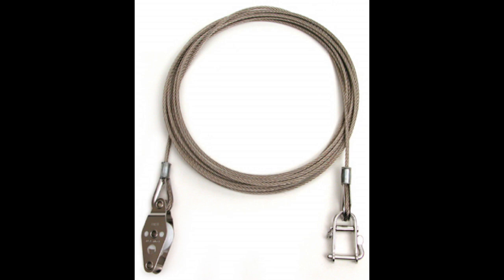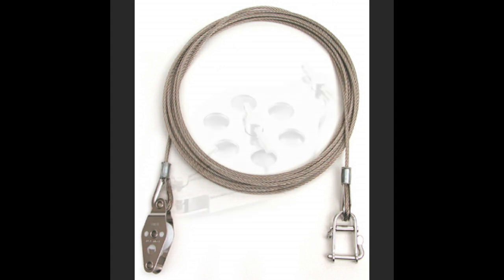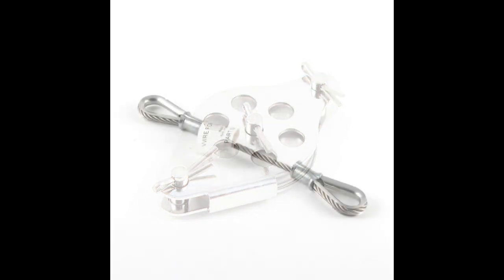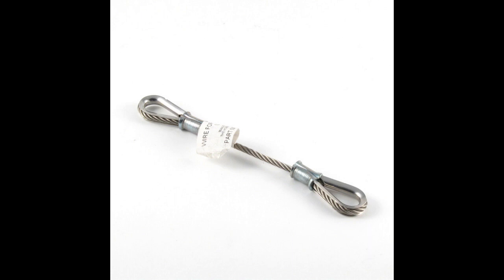In addition to the forestay, you need some halyard parts. So you need the early Prindle 16 jib halyard with the block. And you can get that at Murray's or at eBay. You'll also need a Hobie jib halyard block assembly. You might be able to use something else. This is what I use. It works fine. It looks exactly like the one that was on the ancient jib assembly that came with my boat. They're kind of expensive, but well worth it. And then finally, you'll need the short Hobie 16 upper forestay pigtail. It's about 6 inches long. It's almost exactly the same length as the old corroded one that came with my boat.